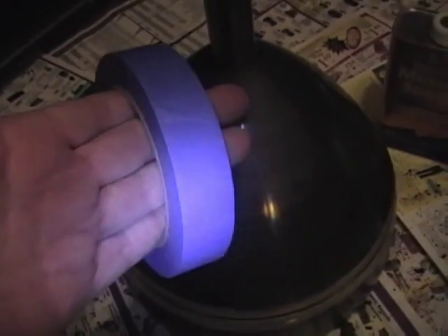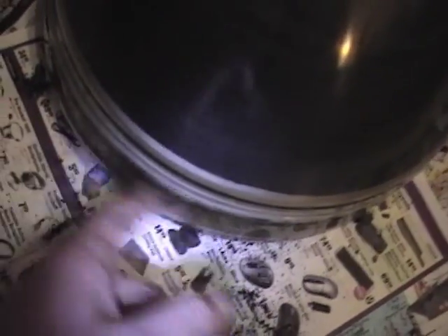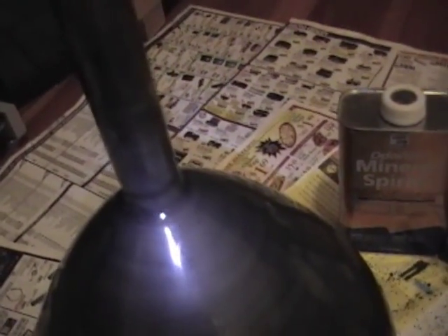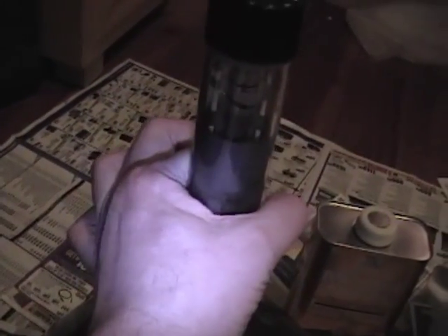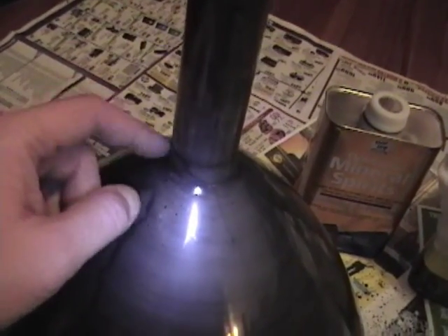First I have to mask off certain areas — in particular, a circular area around the high voltage lead, then around the neck, and then around the front of the tube. One thing I was curious about is that just like a GE set I got recently, this one also has a pinched weld kind of look at the base of the neck. I asked around and they confirmed that a rebuilt tube would normally be cut or pinched up here, but we don't think that means it was rebuilt — it might just be a factory repair or the way it was actually manufactured. But at any rate, time for the tape.